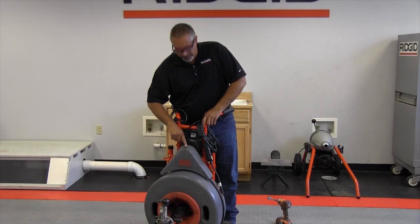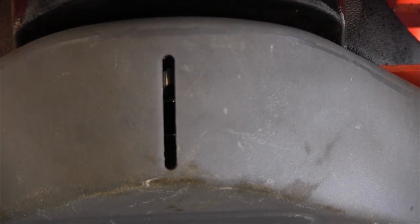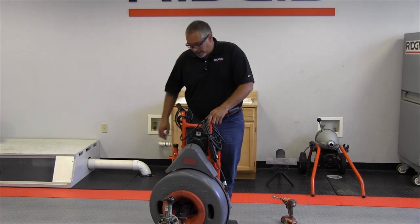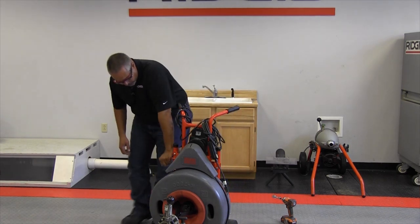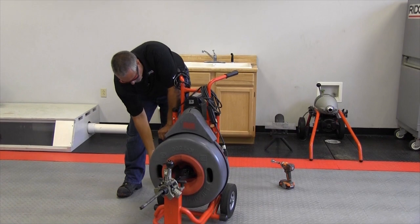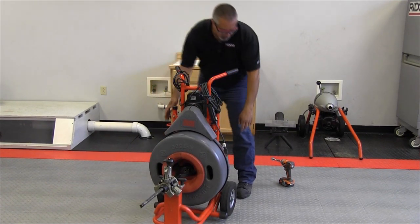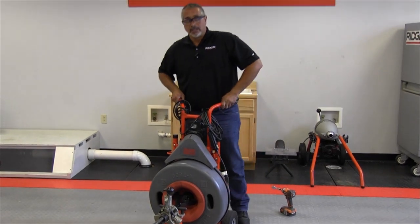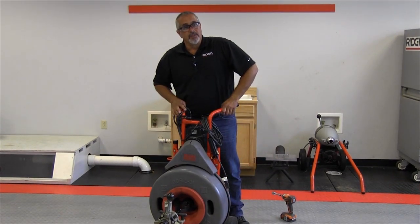On the top here we have this slot, and what that allows you to see is the pulley on the electric motor to make sure that the belt is correctly installed on that pulley. Once you've established that, you can push this spring down again and start putting the belt in place. Don't worry about perfectly aligning the belt — as the drum spins, it's going to self-align itself.